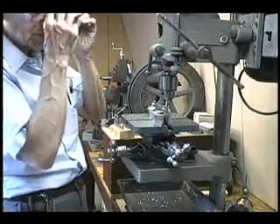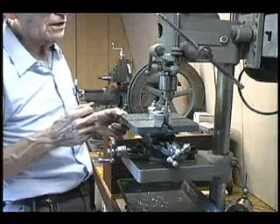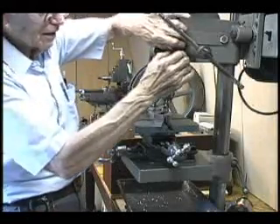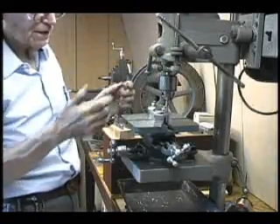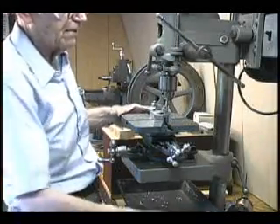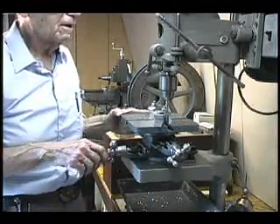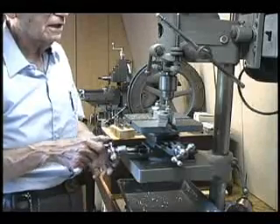The drill press is not as heavy duty for milling work as a milling machine. You work with it a little bit lighter, but you can do useful work with it. I'm going to deepen the cut now. I'll raise my collars and let the spindle come down a little more. You don't want to take a lot of metal when you do this — you're taking maybe ten thousandths of an inch at a time. You don't try to rip out a quarter of an inch. I put a little more cutting oil in, and once again you can see that it's cutting cleanly and well.